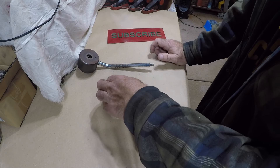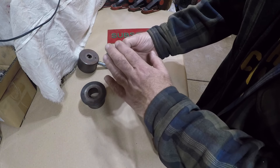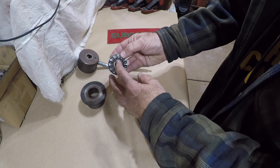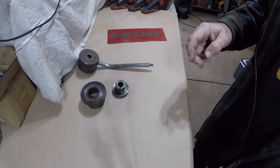The parts are not interchangeable and I cannot get a clock spring for this machine. So what I have to do — and we'll go over this in a minute — is the Bridgeport part will need a key cut into it to match this keyway. Let me explain that, and then let's head over to the mill.